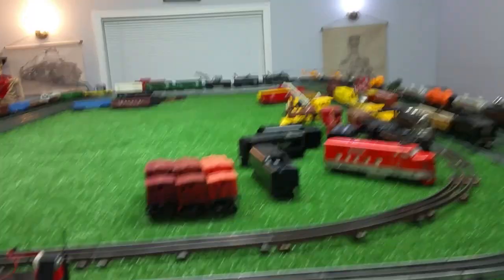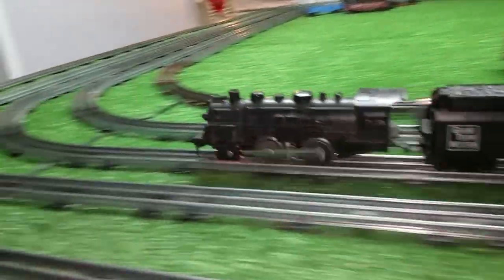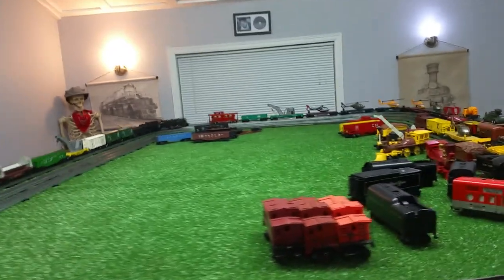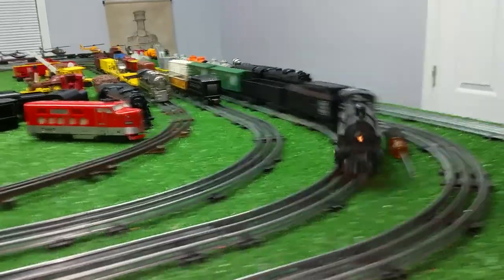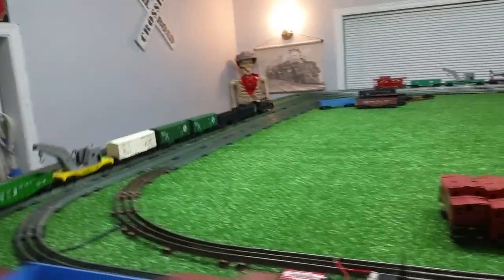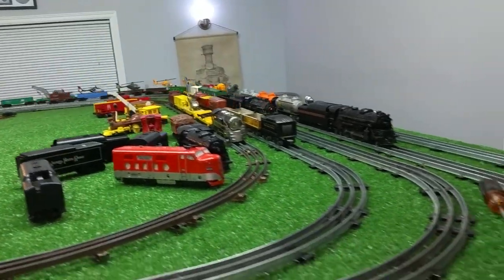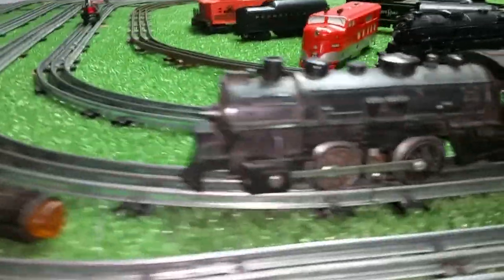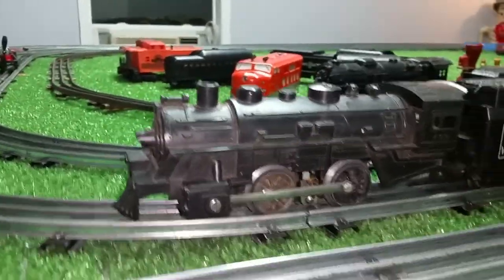As you see — so far from perfect, but it's a running locomotive. A good running motor, actually. I'll just leave it in this old 490 shell until I have a use for this motor. Made completely out of junk parts. I took two front wheels and drilled them to turn them into rear wheels so I could mount those push rods. It's far from perfect, but it works — it's running.